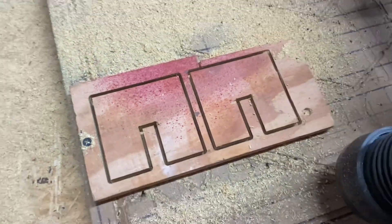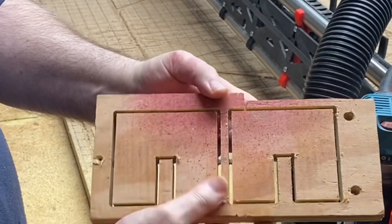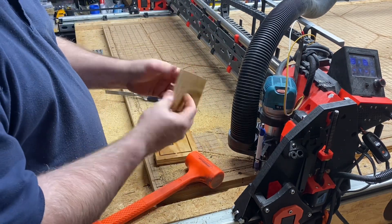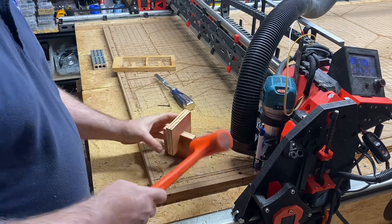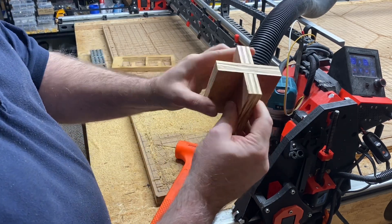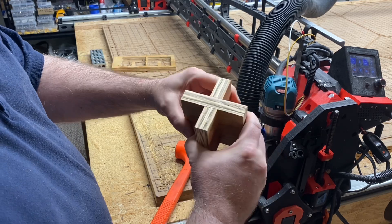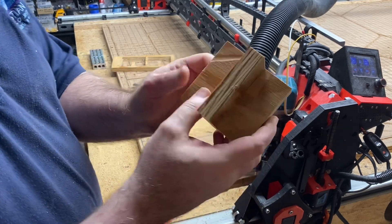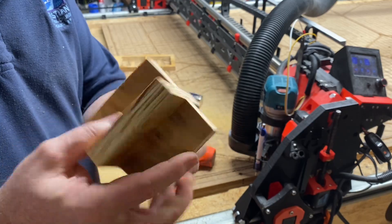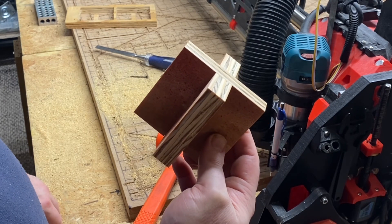Here you see me getting the cut test parts freed out of the larger piece of plywood — and they went together so perfectly. I used a hammer to drive them home, and the friction lock on this is so good that I can't even imagine any need for glue. The torsion box would be so amazing in its strength. Unless you plan on taking it apart later you'll want to use glue, and at that point the strength will just be beyond description — a phenomenal friction fit on a cross lap joint.